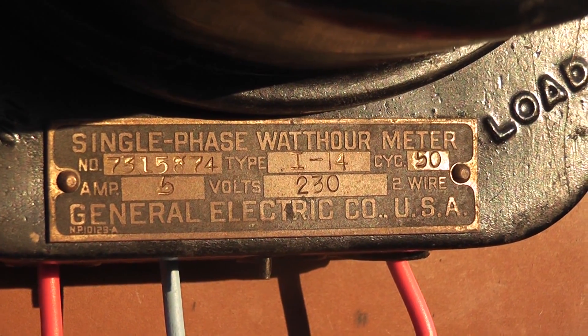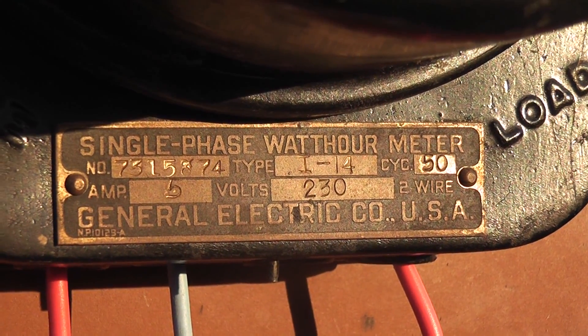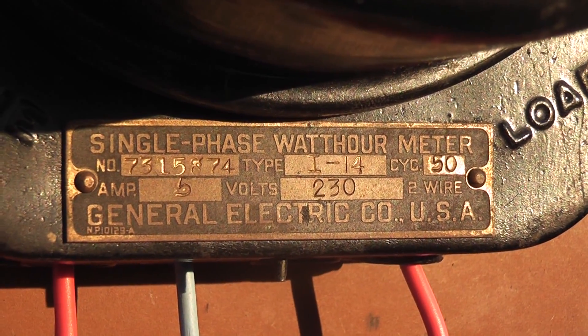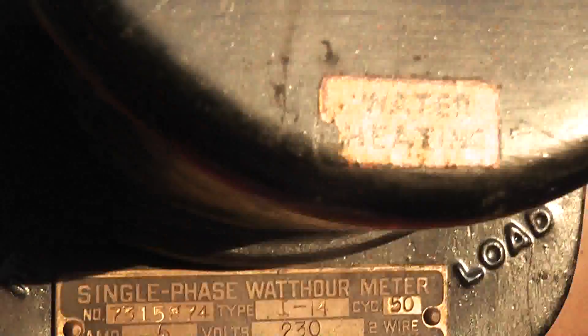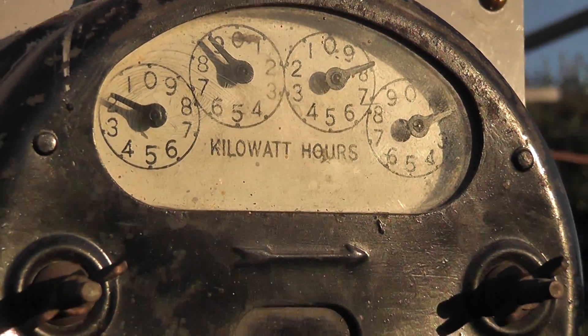The beauty of these rental days — the sunlight is just gorgeous. The i14 is a 5 ampere meter, KH is 0.6, so the meter has 1666 revolutions per kilowatt-hour. It's running a bit on the overload but it should be able to handle that.